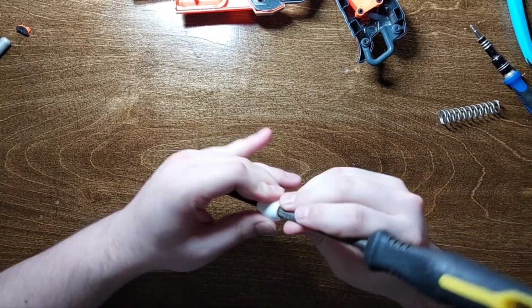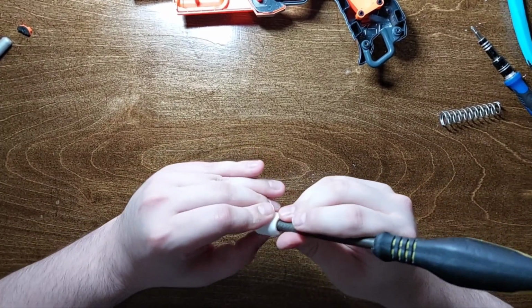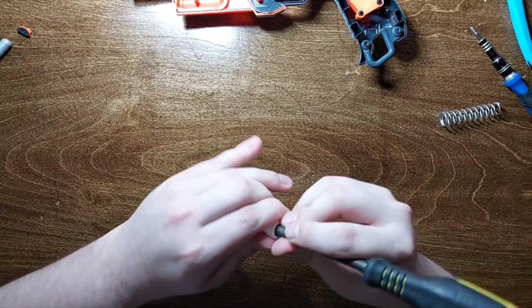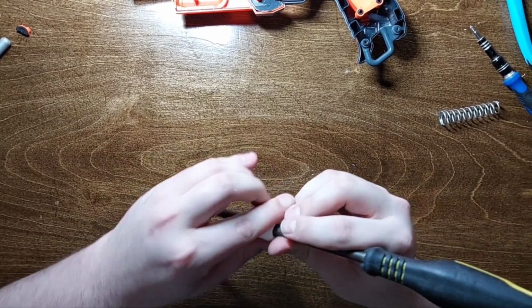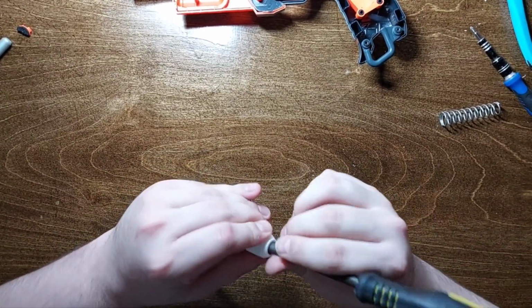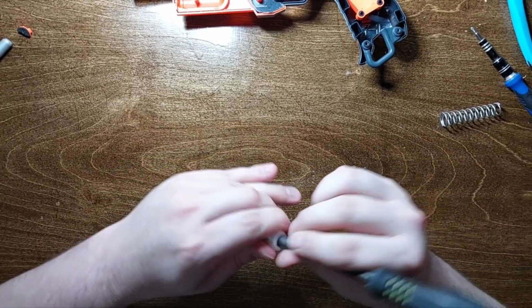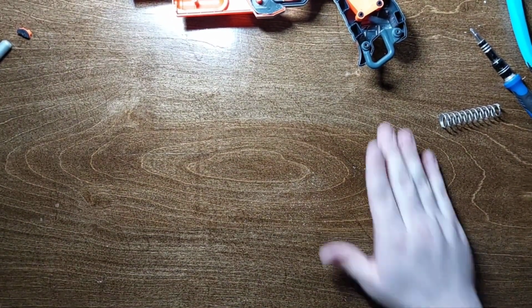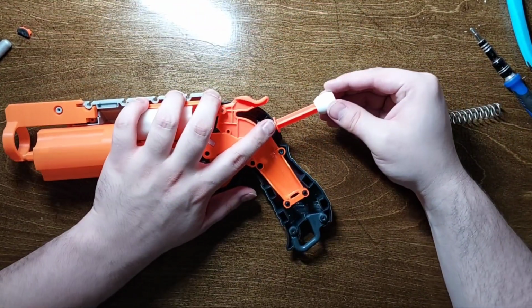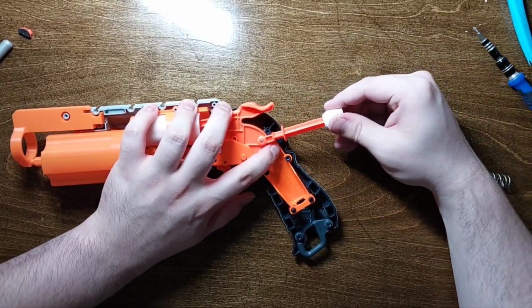Now, really, this should not be needed for you, but do make sure that your plunger spring guide rod fits on this. Sometimes they don't. Sometimes it could be printer problems. I did make this a little bit bigger in the latest version, which is the live version at this point in time. And let's give it another test. Nope, still problems. Still really, really tight on there.